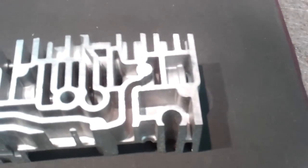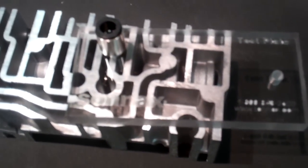When you place the valve body on the pad, it sinks into the pad a little bit, which seals off that port. So when you're testing the opposite side, you're not sucking air from the back side of the valve body, giving you false readings, thinking you have a worn valve when you may not have. So that's the purpose of the pad.